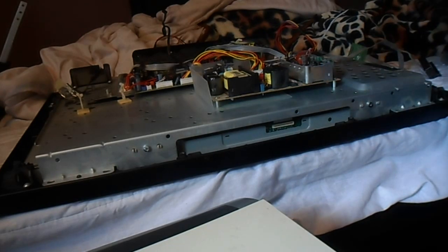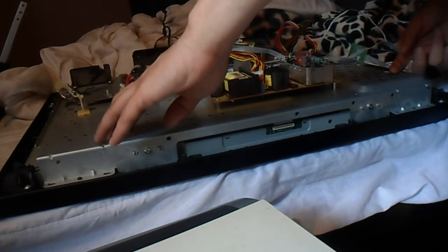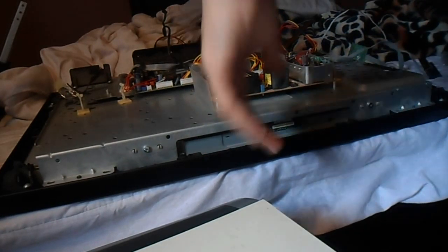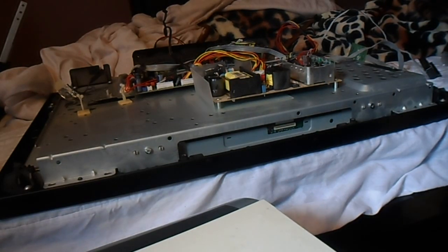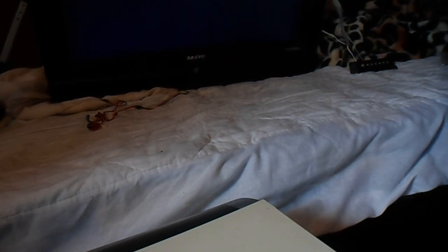What I have done is I have taken the case off and I have removed all but two screws attaching this frame assembly to the LCD panel. By the way, the LCD panel on this is a Chime Opto V260B1. Now as soon as I read that number off I am thinking - I have fixed two previous V260B1 panels with tab bonds. So it is now actually working, but is this going to appear on the frame?